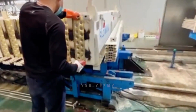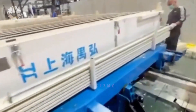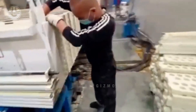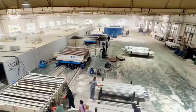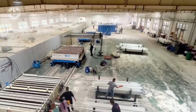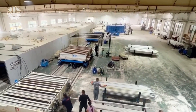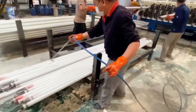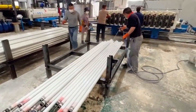After they have carefully positioned and prepared the mold cars, casting starts to take place. This is the process of pouring the prepared concrete mix into the formwork. They need to fill all sections evenly to ensure a high-quality product, using different tools and machines during this step. But first, they need to assemble these rods inside the formwork or mold.